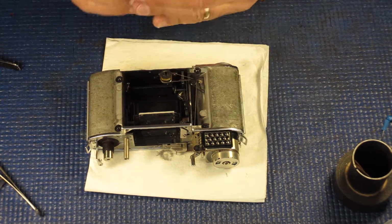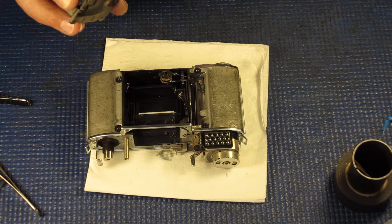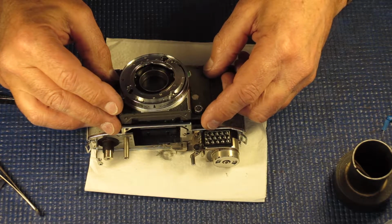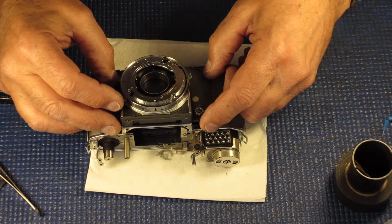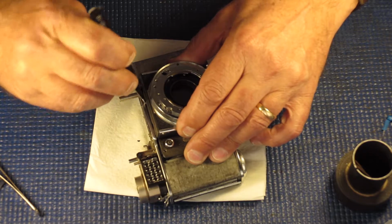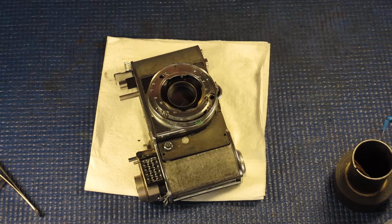This arm goes in that gap there. This hole has to go over that gear, and after that we get on to the difficult stuff. So I lower that carefully over there. Can't feel that gear dropping in. Yeah, that's dropped in. I've got to do this without disturbing those washers, which are just sitting there. Now, I'm going to pull back this chrome trim so that'll drop down a bit. Then I have to hold my tweezers in there and press in the mirror so that it goes underneath that leather strip that I'd put on there, that buffer.